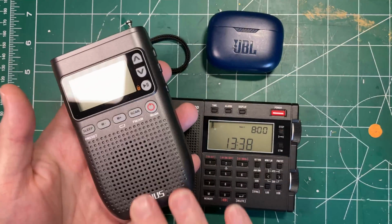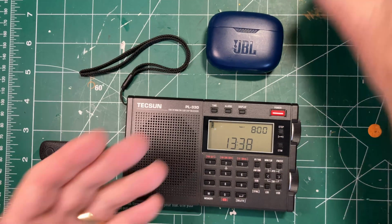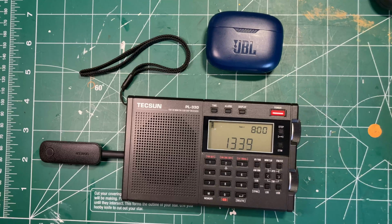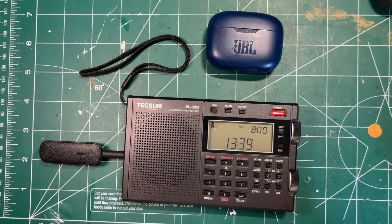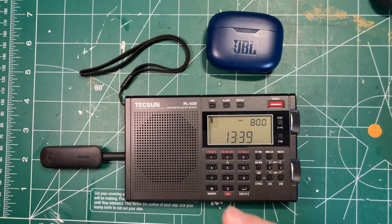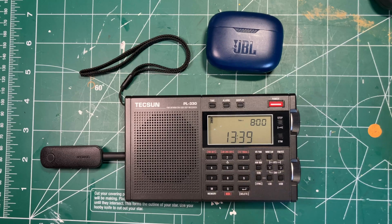Again, when the radio is built around it, assuming it's well engineered, that shouldn't be a problem, and I don't detect any Bluetooth noise on the Prunus. So another good thing about it. So it's okay. Again, an extension cable to get it farther away from the radio would probably solve that problem. You're putting digital electronics next to an analog radio receiver, and that's always going to be something of a situation potentially. But this one is mostly all right, and I don't really have any complaints.